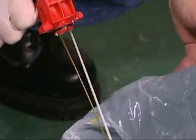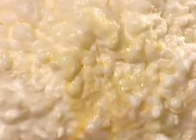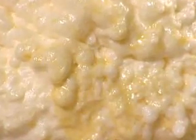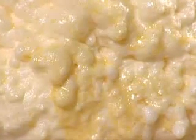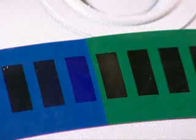Let's say you see more A chemical than B chemical. Your foam probably looks darker in color and may have a crunchy, glassy surface. If you have a stronger A chemical flow, first check the temperature sensing strip. Chemicals that are too cold will result in a stronger A flow. If the temperature sensing strip indicates blue or near blue, warm the tanks until the strip indicates green.